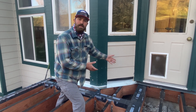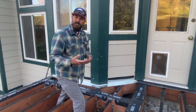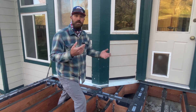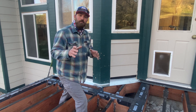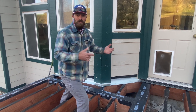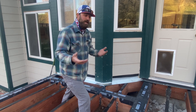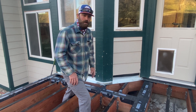With a ground level deck or even a garden level deck, it's pretty easy to do. Once you start getting into walkouts, you've really got to take a lot of siding out and it's a lot of work. But if you plan for it, budget for it, and price it out properly, you'll be able to do it and get away without having to do an engineer letter. But sometimes it might actually be cheaper to have an engineer write the letter — so you've got to do a little research on that.